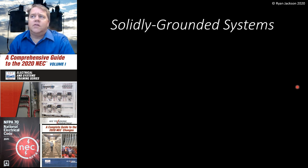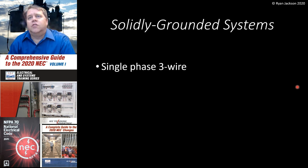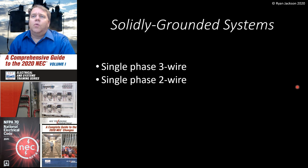But when it comes to the solidly grounded systems that we use here in the United States, certainly the most common, at least in residential, is the single-phase 3-wire system. That's what supplies your house. That's what we've all worked with, and many of us have installed. We also have a single-phase 2-wire system, which is pretty uncommon here in America, although if you find yourself in the UK, this is what you're going to be working with.